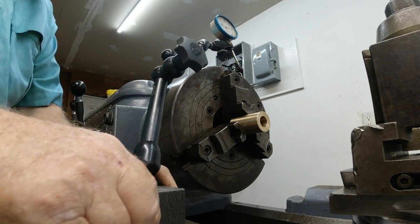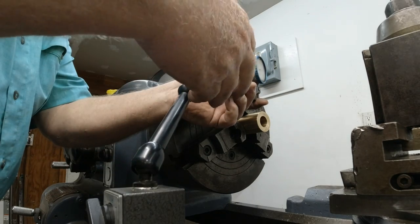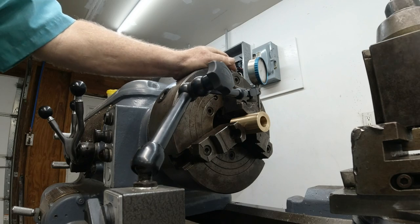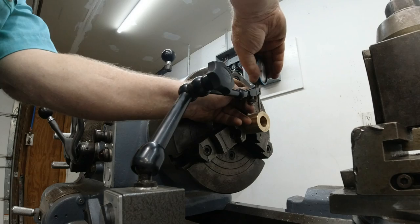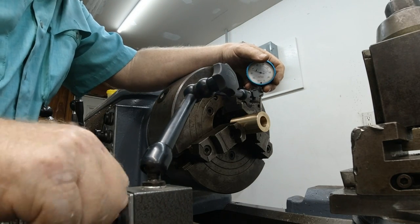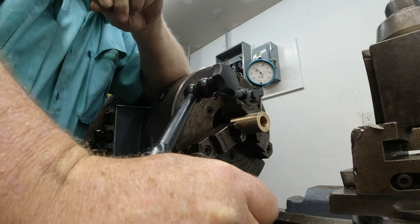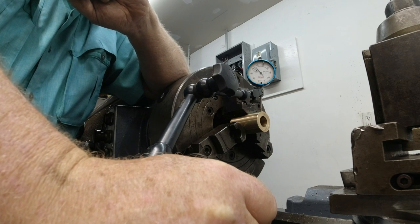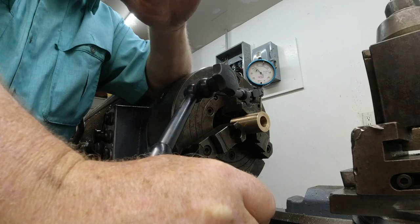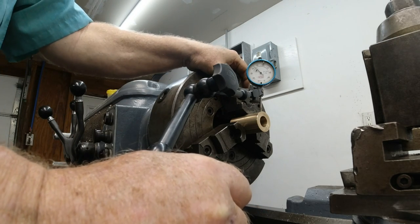I've been thinking again. Dangerous. I know it is. It usually costs me money. But a couple of videos ago, I went to San Antonio and purchased a set of 4-foot pieces of railroad rail, track rail, I guess you call it. And I want to make some gooseneck brake dies for my 4-foot hydraulic press. I was wondering how that steel on those railroad ties hardens. I think it's just the rail that's hardened. Well, I know the top of it gets work hardened, but I don't know if they do any process to harden it first. But I was thinking I need to learn how to do that before I screw up.